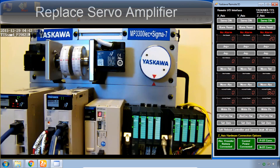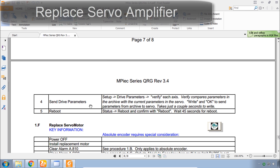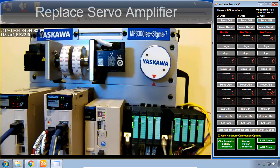Next, what about replacing one of these amplifiers? Let's say we're going to replace the Z-axis amplifier. The quick reference guide section 1.E describes how to replace that drive or servo pack: first install it, set the Mechatrolink address and the rotary switch, then use the web UI or built-in functionality to send drive parameters, before finally rebooting the system. If a drive is replaced, it's going to have the factory default parameter set. Let's go to the setup menu under Drive Parameters and simulate that factory default condition on the Z-axis by writing the factory default parameters.